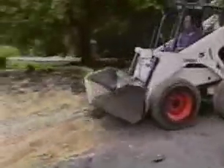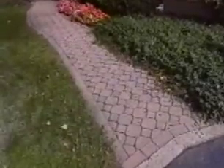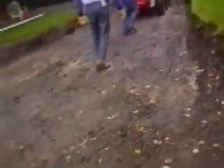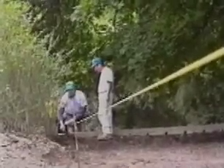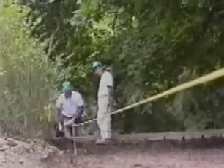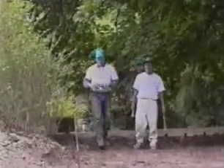You also want the excavation to have enough slope to provide for good water drainage. This sidewalk will tilt down and away from the house, so this planter bed will drain over. You should have a two percent grade from the garage down to the street. Since your objective is to drain water from the pavement as fast as is practical, it's usually better to drain off to the side than down the length of the driveway. Remember that the subgrade surface should reflect the grade of the finished elevation. This side parking area will also drain towards the street.